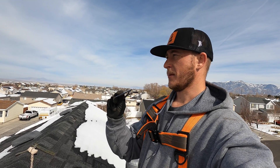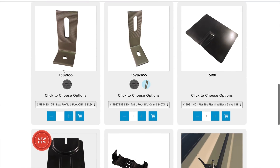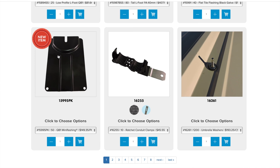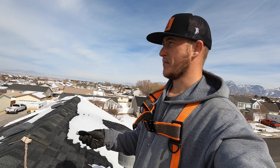If you're on the fence about these and you still want to go with flashings, Quick Bolt makes a popular item called their mini flashing, rather than their micro flashing. You can actually install a flashing over top of this one — a normal flashing that goes up under the shingles and diverts water. That's probably the best solution you could do: the micro flashing and the mini flashing from Quick Bolt together.